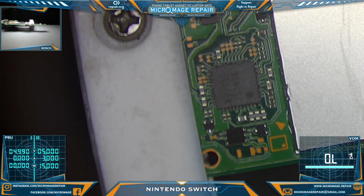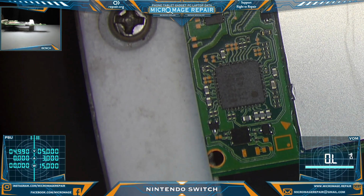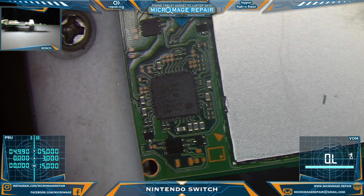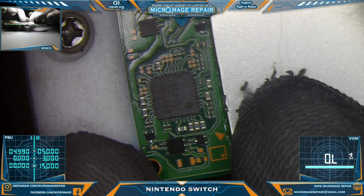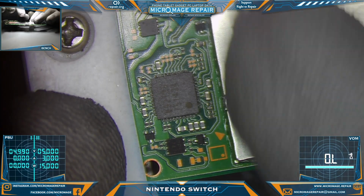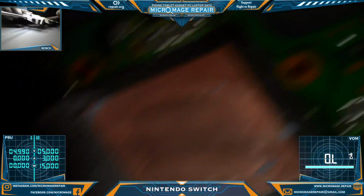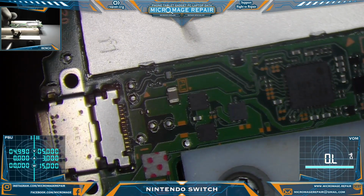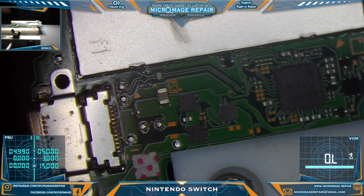So at this moment, just as an educated guess, I am thinking our M92 T36 is failing gracefully. So what I'm going to do is change it out based on this theory. And it's just a theory because I don't have anything that is really telling me otherwise, except I do have one situation on the OEM charger. It was pulling 15 volts at one point and charging, and then it dropped to 5.1 and 0 amps.